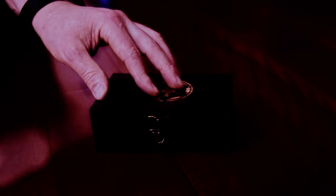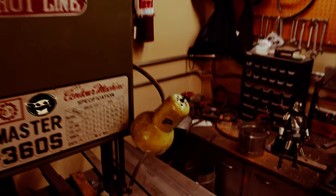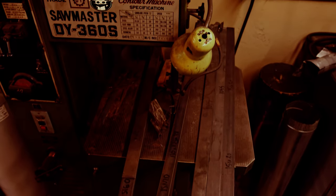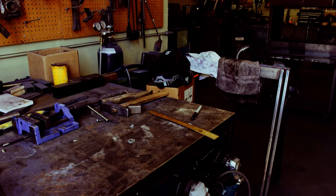In the Mandalorian, Beskar is the steel from which Mandalorian armor is made. Curiously, when looking at the clip from the Mandalorian, it looks a lot like pattern welded steel, and it's nice to see that the show took inspiration from the swordsmithing craft. To get started, I need to select the steel I want to use. 1095, a plain high carbon steel, and 15N20, a steel with high nickel content, won out.